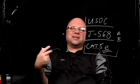So I said to the client, look, this is the situation. Technically, we should pull another wire, but it's your call. The client is our master in some cases. When it comes to compromising safety, then no, you're responsible for an installation that is safe. But when it comes to this, it was the client's call. It's going to cost you this much extra for me to pull another wire, but it's still going to work. Now, I don't know where the break is and how severe it is. Are the other pairs compromised? Who knows? But right now it works, so it's your call. The client wanted to keep it that way. That sort of conversation involves some knowledge. If you didn't know, you would just say, no, we need to re-pull the cable, and that would be it.